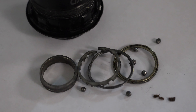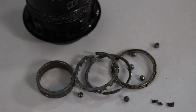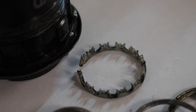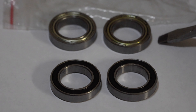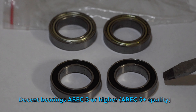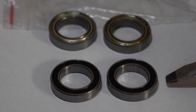So this is what it looks like after we pull the cheap bearing apart - what a mess. These things are useless. Forget paying this kind of price for bearings - you need something far superior. Don't use the cheapest type bearings available. Once I got it apart, I realized the bearings actually have plastic parts inside - the cage is actually nylon plastic. We really don't want that inside a bearing; we want it to be strong. There's also a lot of movement back and forwards on the centre of the cheap bearings even when brand new. The second bearing - the $10-$12 ABEC 3 or ABEC 5 bearing - has no movement back and forwards on the centre. These should be pretty good; let's see how they go.